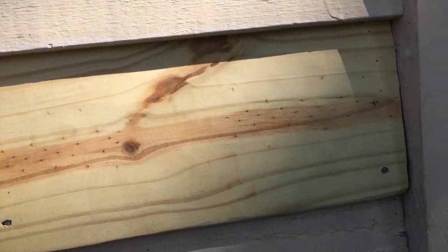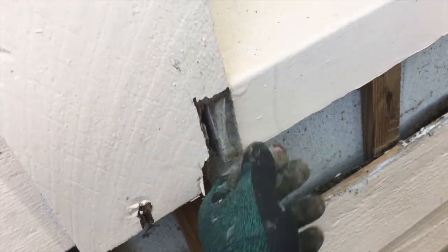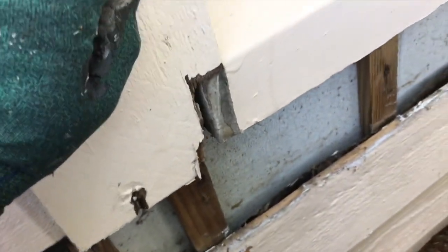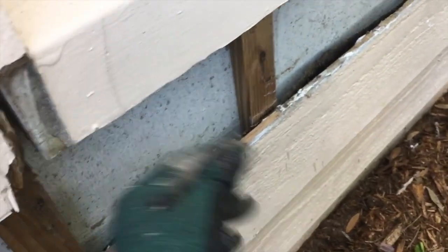Remember I replaced that piece there. We're going to paint it and we don't want the wood rotted. I didn't find any flashing under this window sill here. There's the board — rotted at the end. I dug that out to see how bad it was. It's cedar, and the rest of the wood in the center is pretty good, but there's rot down at this end where the water ran in where there was no flashing.